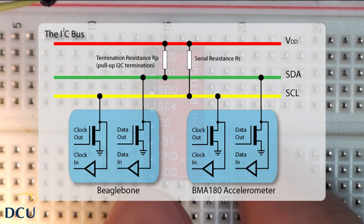Synchronization is the procedure to synchronize clock signals between the two devices using the SCL line. Once synchronized, data can be sent over SDA. The SDA and SCL are bi-directional lines connected to the positive supply via pull-up resistors, so when the bus is free both lines are high. The outputs are open drain, meaning voltages are not fixed, so we can mix different logic families and add any number of devices — subject to wire capacitance. The wire capacitance and termination resistor RP (typically 1kΩ to 10kΩ) affect signal behavior and communication speed. SCL and SDA must be sampled by Schmitt trigger inputs for hysteresis.